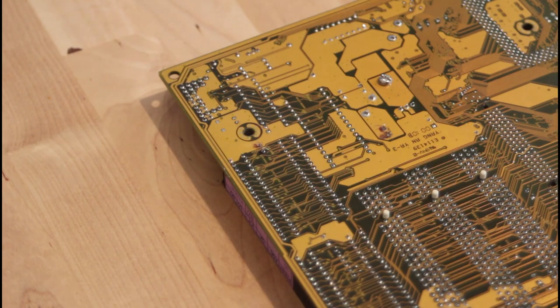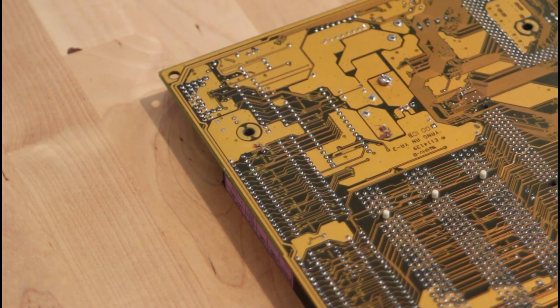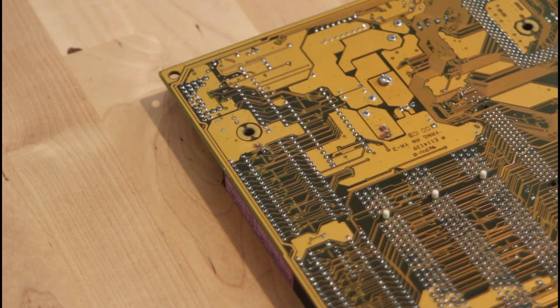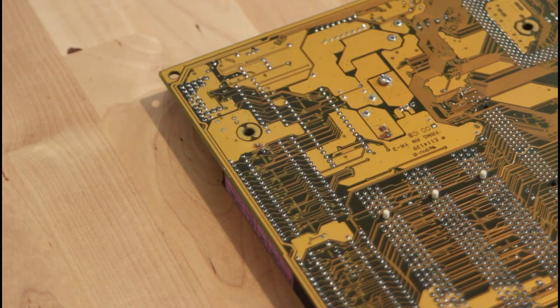For this capacitor I actually soldered on both sides of the board because there are no traces on the faces of the board as far as I can see, apart from this big pad, so I suspect there's actually a connection inside the board — which surprises me, as I wouldn't have thought this board would have more than two layers. I checked all the nearby traces where that mark is and everything's fine, so I think we can just power this up now and see whether it works.